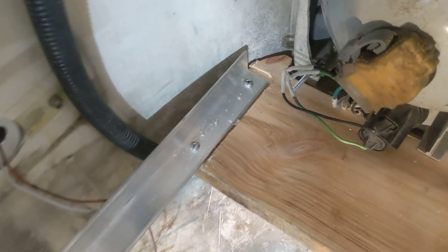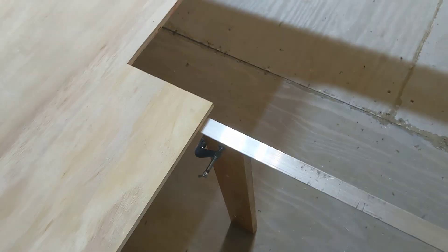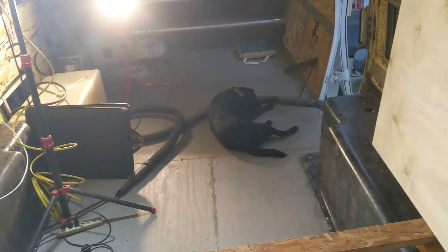You can see that we anchored aluminum channel across and then rabbited that down so that this is flush here. And then I have another piece of one-inch angle that goes across, and there's going to be a board supporting that. Right now it's just being held up by this little temporary support to hold it in place and give me an idea of what's going on. But then I'm going to box in underneath — some of underneath will be inside storage and some will be outside storage.